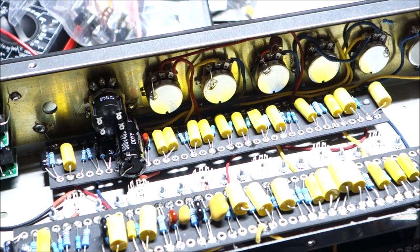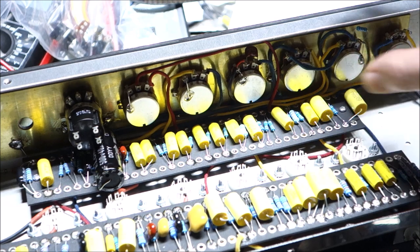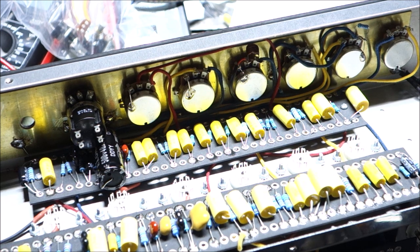And again, I'm happy with how not jumbled the wires have become. It's very easy to make a big mess, and it's actually very difficult to keep that beautiful 90 degree pattern that was so common with UK amps that were made by a lot of guys that were former military. A lot of experience, but again, I'm trying to keep everything neat, try to get a relative 90, get some nice little sweeps and keep the wires out of the way so they're not a big disaster. And it's working pretty good. So, I'm happy so far.